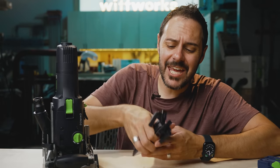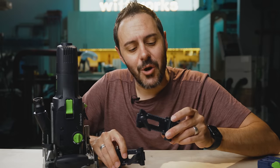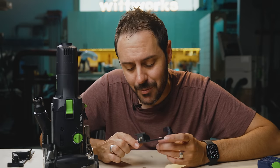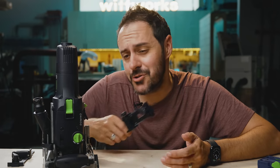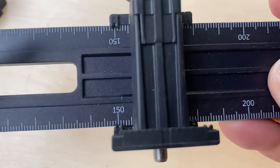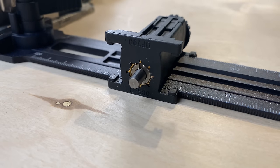The kit I have came with cross stops — they're really, really cool. They go on the base and provide a positive place to reference your existing mortise. Without them, you'd measure out where you want all your mortises, draw a line, and line them up by eye. But with cross stops, you don't even need to mark or measure. You set your spacing width, put the pin in your previously cut mortise, and go down the line making quick work.